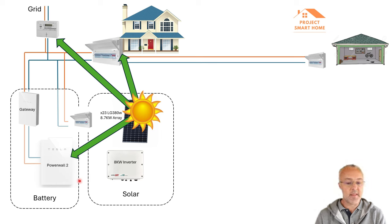I moved at that point onto a tariff from Octopus that allows you to charge the battery — I think it was something like between 4 and 7 in the morning. So if the Tesla Powerwall felt it was appropriate, it could pull cheaper energy down from the grid, save it in the battery, and consume that during the day if we're not getting the solar. Ideal for the autumn and winter months. So that put me in a pretty good position where I could either consume the electricity myself, sell it back to the grid, store excess energy in the battery, or even pull energy from the grid to store in the battery during those cheaper Octopus electricity hours between 4 and 7 in the morning.